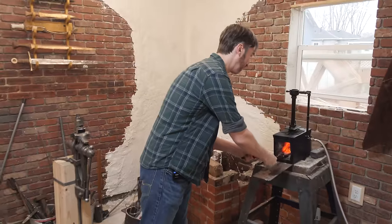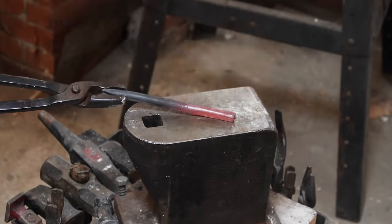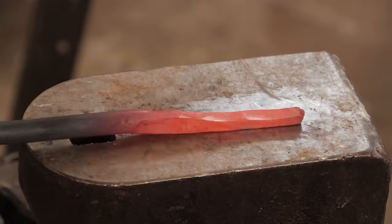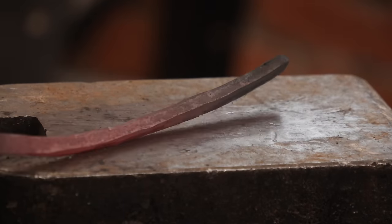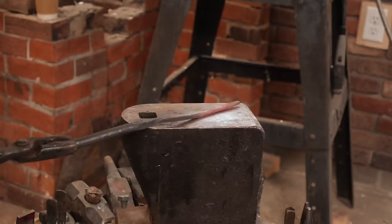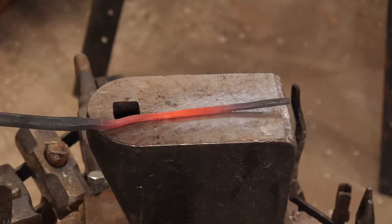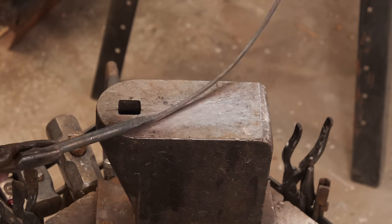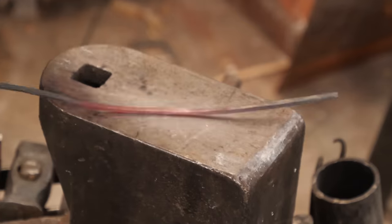The process is kind of insane — it's very laborious and it was a huge learning curve for me, especially understanding the annealing process. What we're going to start out with today is just a scrap piece of round rod, probably somewhere between a quarter and a half inch. The idea is we're going to draw that out to the most narrow diameter we can — first drawing it out square, getting that as long as we can, then knocking out the corners to make it an octagon, and rounding that off. The smaller we can get it here, the less work we have to do when we pull it through the draw plates.